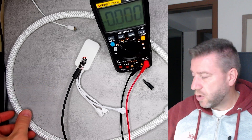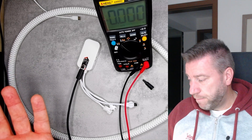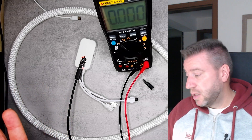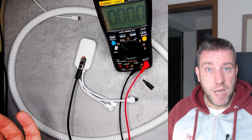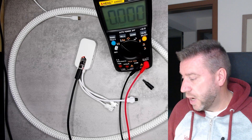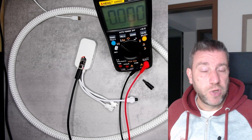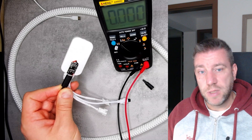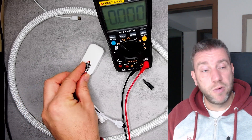It's giving out 20 volts, which obviously fried the LED strip. I still want to play around with this light, so I'm considering buying another rope and keeping the controller since it still works. But if this USB-C trigger board behaves like that, I can't rely on it. The other option is to just use a simple USB-A cable, cut it, and plug it into a USB-A socket — power banks usually only do 5 volts that way, so there's no risk of overvoltage. I have these trigger boards and might use them for other projects, but I want to make sure they're reliable and not suddenly switching to unexpected voltages.